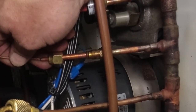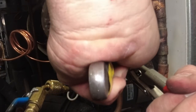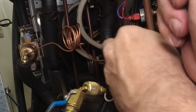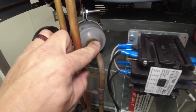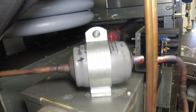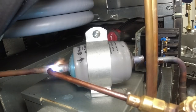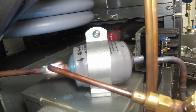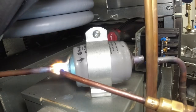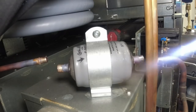You can see that's hitting with the curve right there. Get that silver filter dryer changed out. The reason I did not cut it out and clamped it down is this thing is a major pain to get back into place — you'll move these lines all over trying to get them out, and there's not a whole lot of extra here to work with. You can always put that piece back on and it'll be alright.